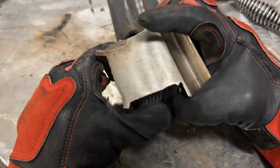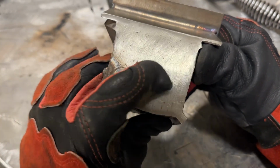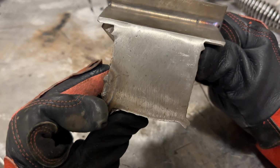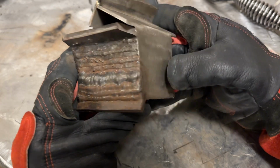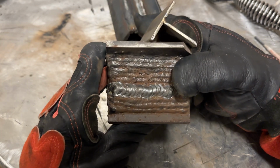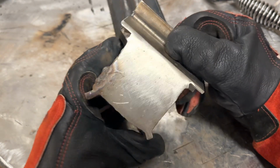And if you had any major signs of porosity, you would get docked points. Now, some of those spots look like porosity. It's just filth on this. This thing's been sitting around for a while. But if I recall, I only had like 1 or 2 very minute bubbles of porosity in this whole thing, which I was kind of surprised at. And I definitely didn't clean this as good as I should have. That's all stuff that you learn, especially with 6010. But it wouldn't hurt to do something like this.